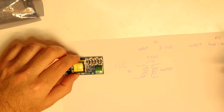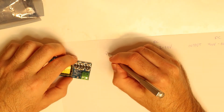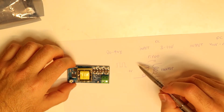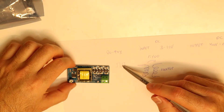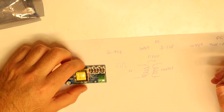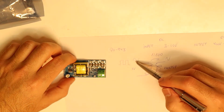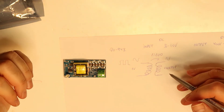This is not exactly the same number because the coil is never 100% efficient — it's usually between 80 to 94 or 95 percent efficient. So the result will be a little less than 100 volts. Usually the best way is to transfer a sine wave and get a sine wave out, but because these circuits are made very cheaply, it is not a sine wave — it's usually a square wave or a modified square wave, not exactly a sine wave.